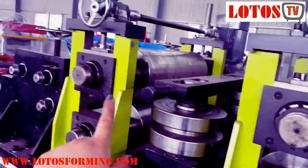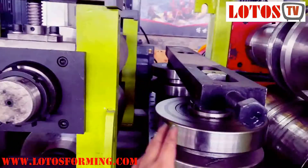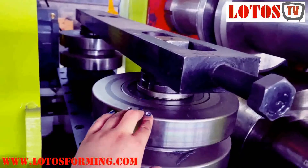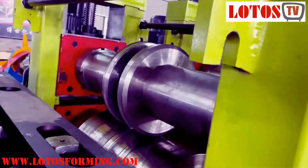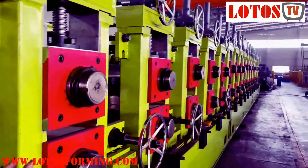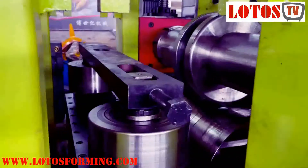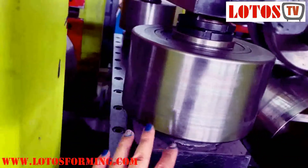The first station and secondary station are the feeding stations. Then from the secondary to the first forming roller unit, we also have this sort of vertical guiding roller on the left and right side. From this station we go into the forming steps, combined across 16 rolling stations. This is the first unit, then the secondary unit. Between the first and secondary we also have this feeding guide.